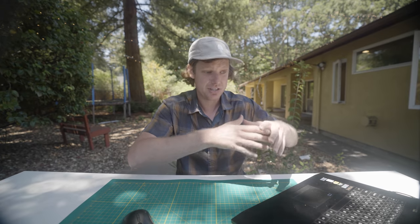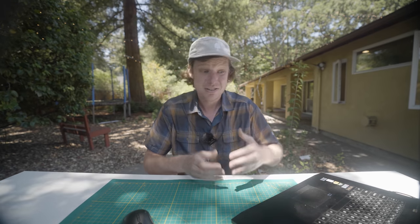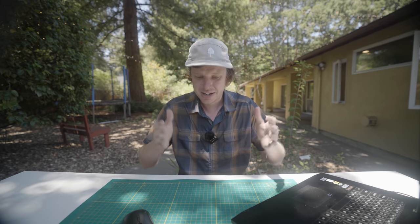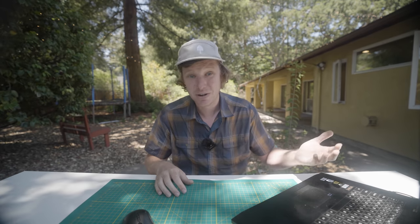Now the L1's very inexpensive. It does capture good data if you want to see just the general overview or if you want to capture some less dense contours. So maybe a 2-foot contour or a 10-foot contour, no problem all day. But when you're talking about survey grade systems, you really need that repeatability and that accuracy. And today we just didn't see it. I didn't see it on either one of these data sets, and let that be what it is. So that is basically my findings from the R2A, the L1, and the Riegl miniVUX. There's a large difference in price, and when you need accuracy and survey grade, you're going to want to use a miniVUX or this R2A. And if you just want to have the overall view, if you're doing something that's not so stringent on that accuracy, the L1's a great option.